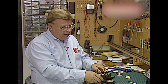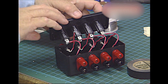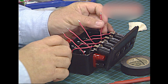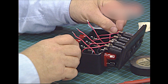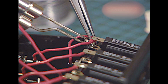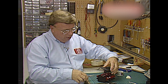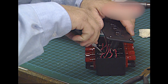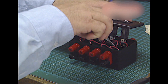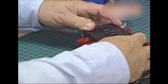Take care of the fourth one. Now we've got to raise this up and comb each one of these wires through like that, then turn it around and put these in the same way — just bend a little hoop in it, hold it, and solder it in place. That completes the last one. Now we'll take these wires and give them a little help tucking in, because they're big 16-gauge wires. Make sure they're all starting down fine, then put the lid on — and there's our box.